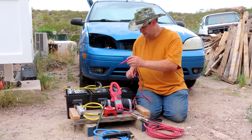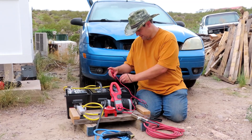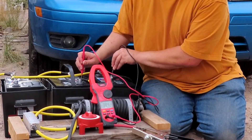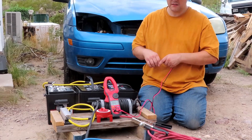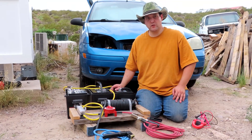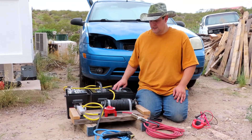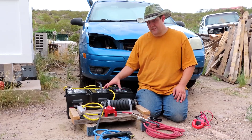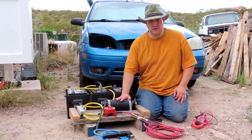So we've got about 38 and a half volts — a good amount of power. The batteries are wired in series, and that's how I get 38 volts out of these 12-volt batteries. This one jumps to this one, which jumps to this one. I did it that way so I could have these two here going into the welder power supply.